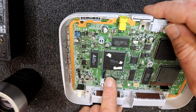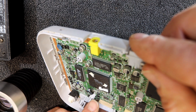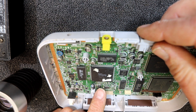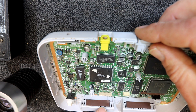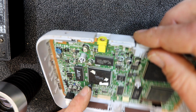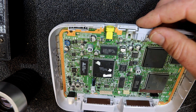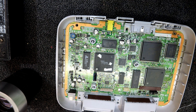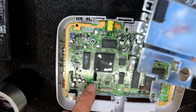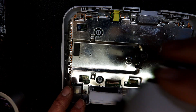It's got a C721 there, and C738 is pointing to this, and C721 I think is going to the same spot. So I'm not sure what this is actually called, but it's right next to Q701 and that little laser mount there - probably C705 maybe. That's where it's located, right near where the laser mech sits.